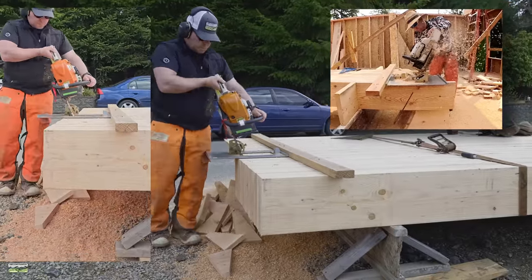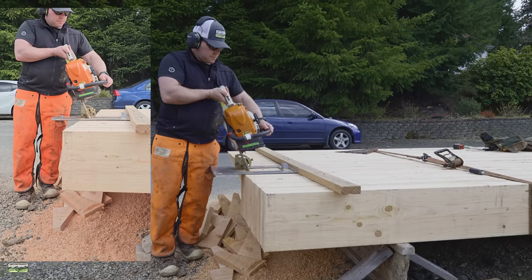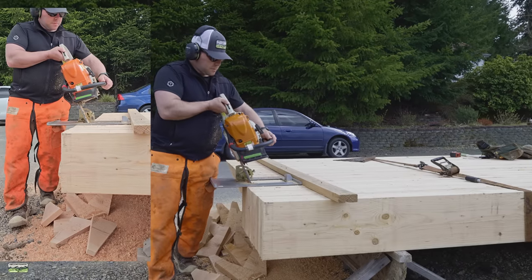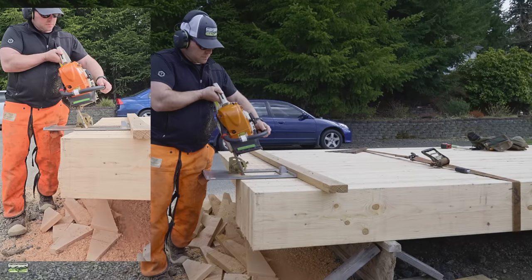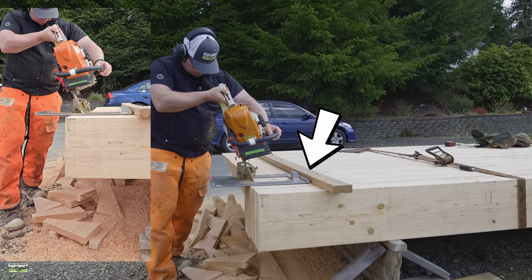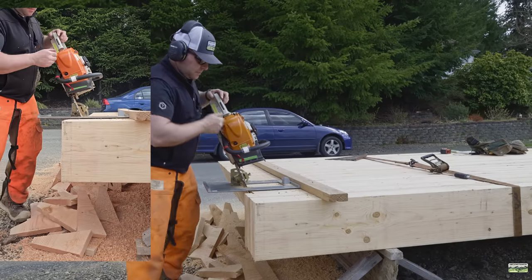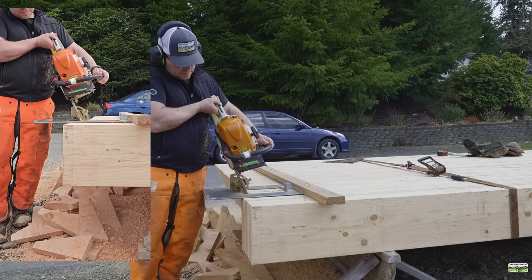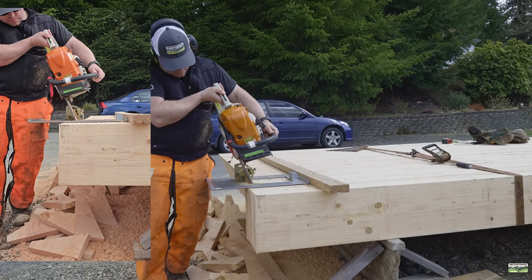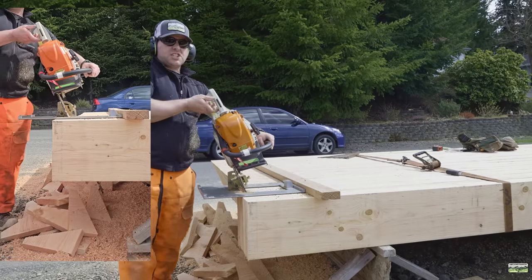That's how I usually do it, but then people tell me I'm doing it wrong — you can't please everybody. Now, I'm going to leave this in because it's a good teachable moment. It all looks like it's going great, but I start to wander off the guide because I let off the pressure — see how it climbed away. Now I'm going to go back and recut. Here's the thing about using the chainsaw: you can't just trim a quarter of an inch. It takes some movement and finesse. The bar and chain keep trying to find that first cut, so I'm just fighting it slightly to trim off the amount I gapped off the guide.